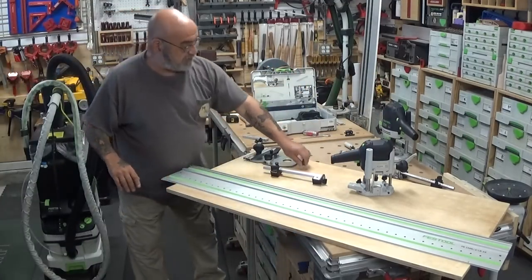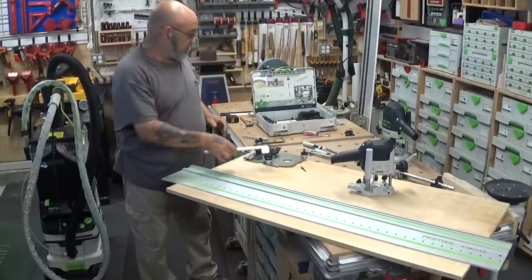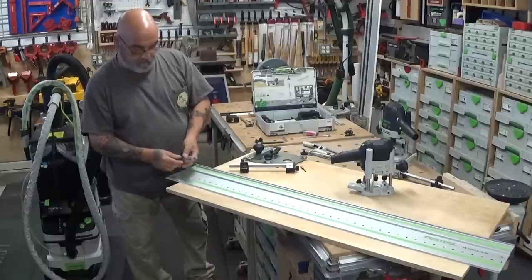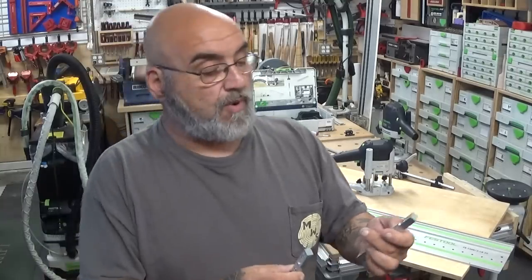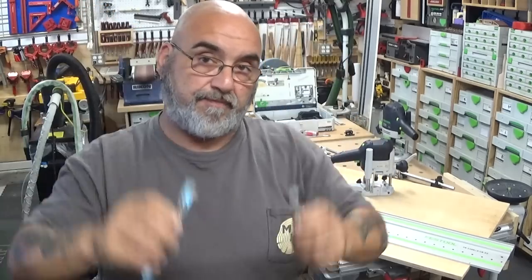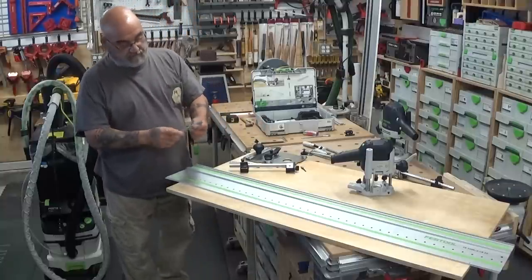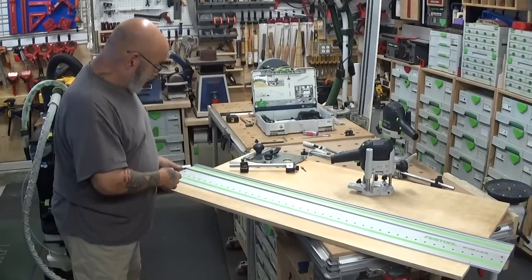It comes with 2 clamps, these screw clamps. Comes with 2 positioning rods, which I'll get to in a minute. Comes with Allen keys, and it comes with these 2 depth pieces that are used in different increments. You have 9.5, 32, which is on one side, and then 16 on the other. For this, we're going to be using it for shelf pins. If you're going to be using it for shelf pins, you want it to be what they call 16 up and down. So when you're positioning it onto the rail,